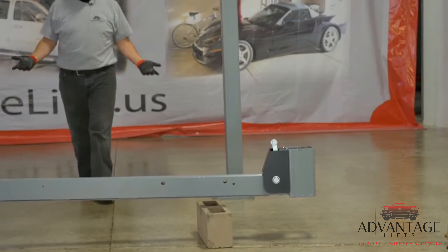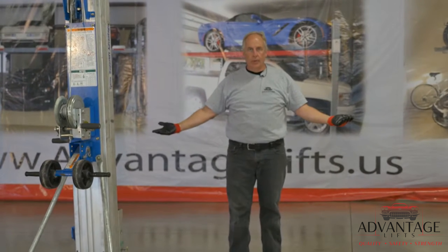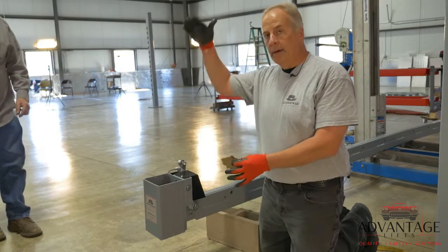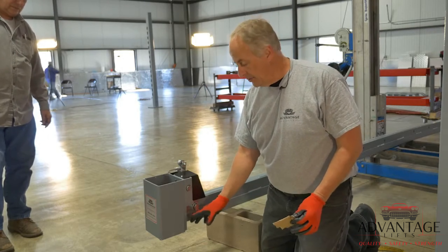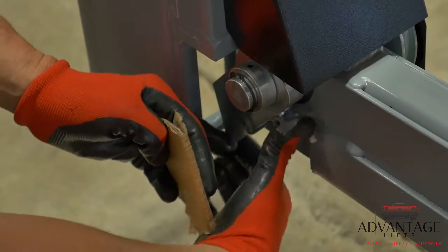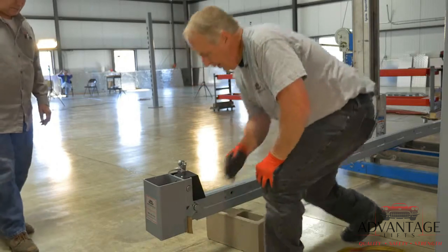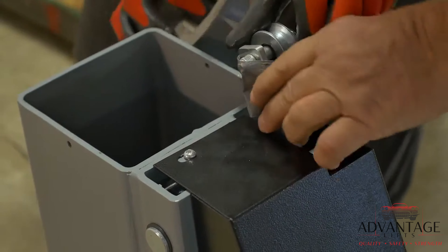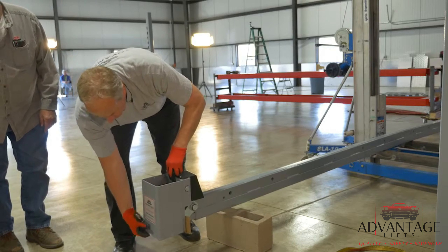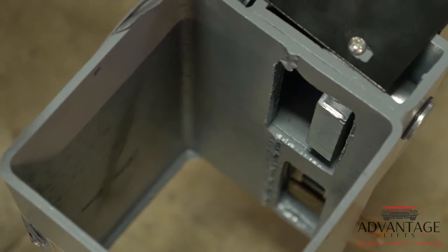I'm going to show you two different ways of doing this: one by using the genie where we raise this cross arm up and lower it down onto the post, and the other side without using the genie. When getting ready to stand this up to go down the post, we have to open up the locks. Open the lock with your finger, pull it back, stick a piece of cardboard in to hold the lock open. On top, on our ALI certified lift with the secondary lock, take a piece of duct tape, wrap it around the handle, and tape it to the bottom of the bucket to hold the secondary lock open so no locks protrude out — it'll slide down the post.